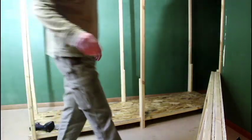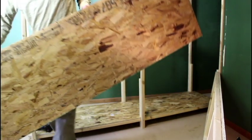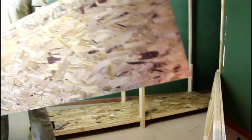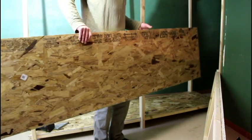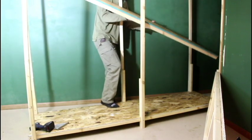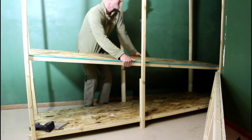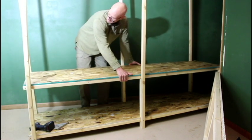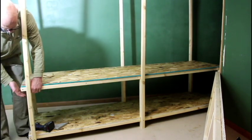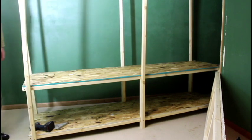I double-check to make sure the legs are running straight up and down — you can check them on the floor and on the shelves. You'll be able to adjust a little bit after the next step, but you want it close. These 18-inch pieces go in now — we're going to put them so that they make contact down at the bottom and then screw them into the legs. Now I'm going to put the next shelf on top of those 18-inch boards we just screwed in. This is fine even in a tight space — just make sure the legs line up with the marks at the same place all around.